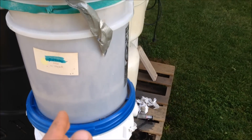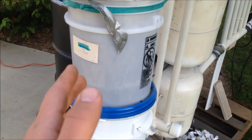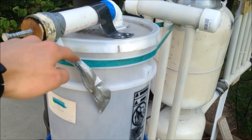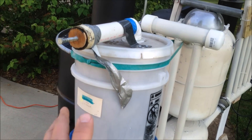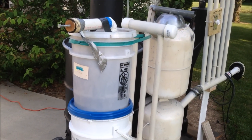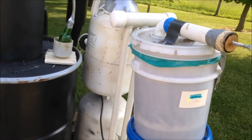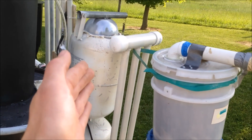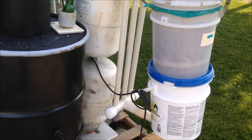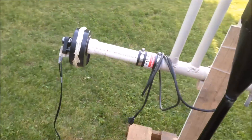The only thing I haven't done that I said I was going to do is fill my last filter full of scrubber pads. I've filled it instead with hay - about that much - with some steel wool around the edge to keep the gas from bypassing to the edge. I want it to go through the center through the hay. I've got big chunks in one filter, wood pellets in another, and hay in the last one. With three cyclone filters, I should be good on catching ash and small particles.